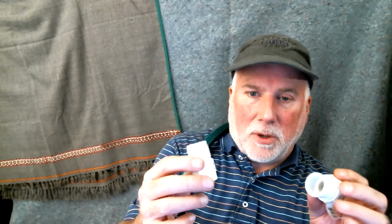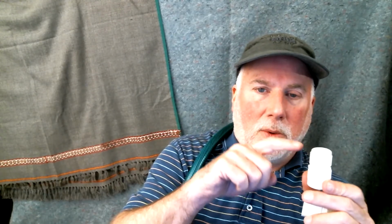But there you go. That's a demonstration that these are genuine adapters that go from a 1/2-inch PVC pipe to a genuine hose thread. And you can use these to adapt from a PVC pipe to a hose. And these are found in the irrigation section. I found them at Lowe's, but I understand they are available on Amazon. They're not in the plumbing section, and that is what everybody's finding so confusing. You would expect these to be in the plumbing section, but they're not.